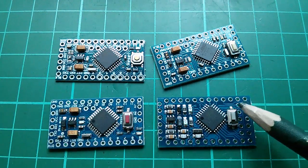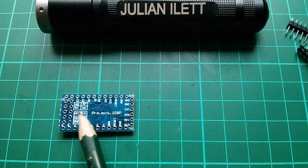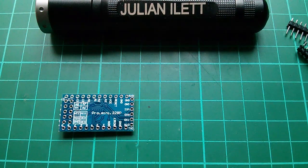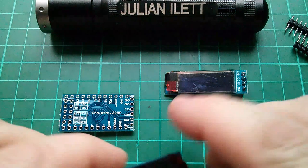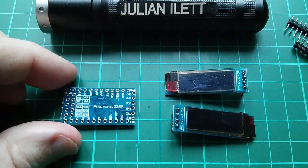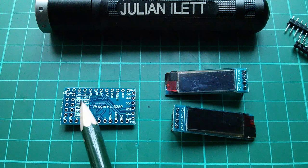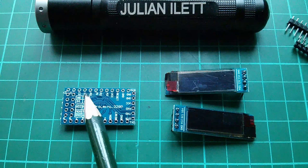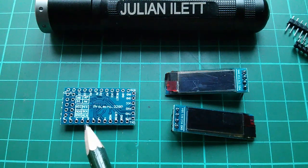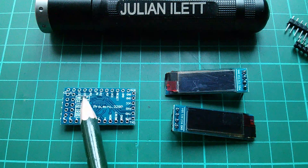It's at these bottom six pins, and then the four pins here are A4, A5, A6 and A7. Why did I buy this Pro Mini? I don't specifically want the ISP header, but what I do want are the four connections for these little OLEDs, and I wanted them over on one side of the board so I can sandwich the OLED on top of the Pro Mini. I need Ground, VCC, SCL and SDA - and here I've got Ground, VCC, A4 and A5. SDA is A4 because 4 is the fourth letter of the alphabet - the D ties up with the 4, and SCL will be A5. It's pretty good.